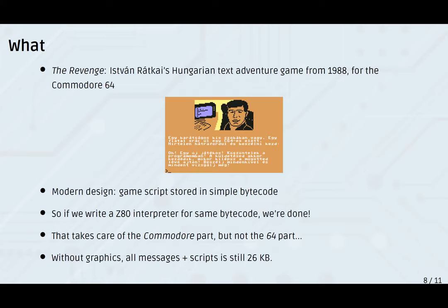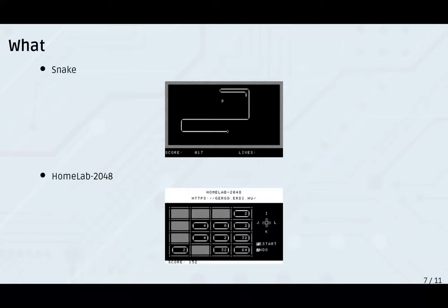So this is 1 bit. You have 64 bits, or 8 bytes, for each character in the ROM, and you can't even change that. So the character set is fixed. It's an 8 by 8, 1 bit image. But you can see here that it's not just letters. You have this nicely rounded corner, right? That's a character. These fancy double arrows, that's a character. Here, if I had the device when I made the screen, you'd see a heart. So yes, there are lots of characters that are cool for writing games like this.